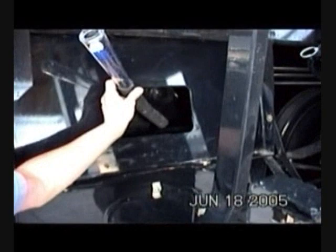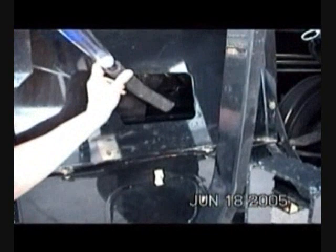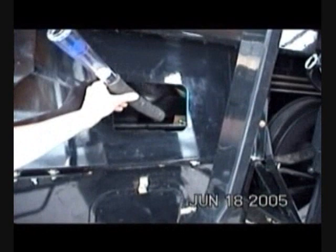To demonstrate how positive the flow of air escaping the shoe is, a simple rain gauge with the bottom cut out and a ping pong ball is used. Here we see a hose attached to the rain gauge positioned in the area between the auger housing and the shoe. The ball moves from air being pushed up the hose from within the combine.